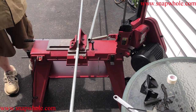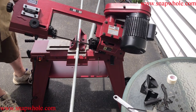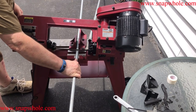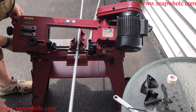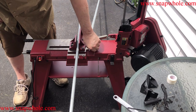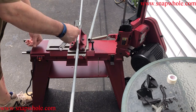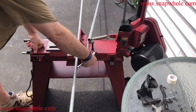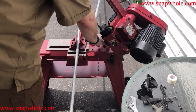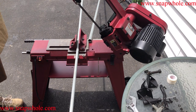Since this is my first cut and I didn't do any test cuts, I don't know exactly where it's going to cut, so I'm going to lay the blade down and line this up. When I was storing it I set this stop — I want to remove that for right now, because if I don't remove it I can't get it to go down below the surface. It looks like the only time it'll be on is when it's in storage. Let's make our first cut.